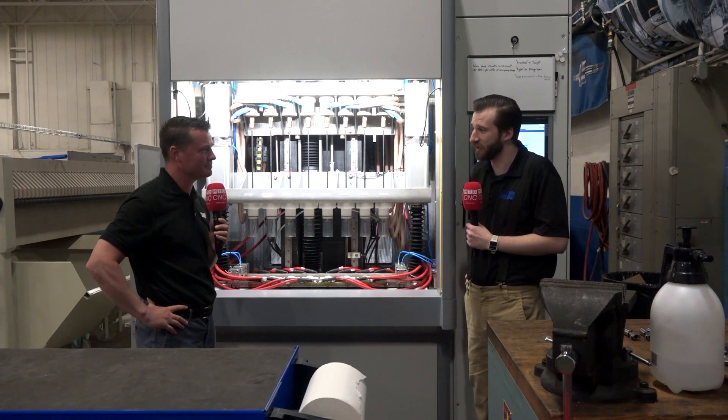Good to be here. Electrochemical machining is a process that's sort of like reverse electroplating — that's the easiest way to think of it. We've got an electrical process and a chemical process all occurring at the same time, and it drives machining.